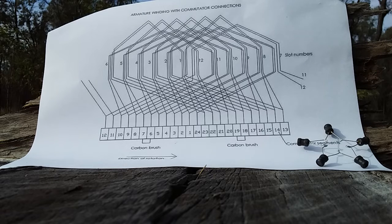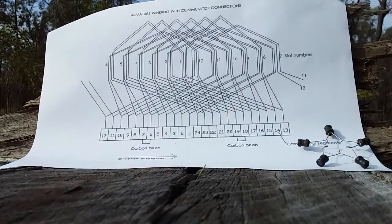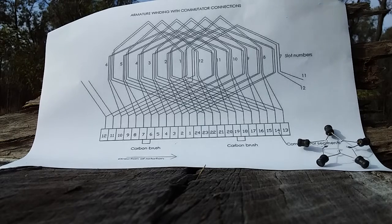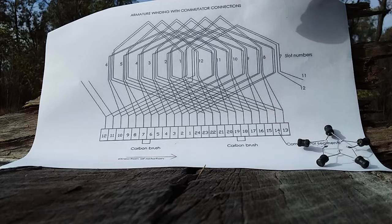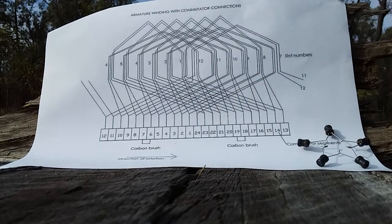As I stated in my last video, the rotor coils are joined in one big coil. You can see it there — you can see 11 and 12 come off, they go over here to 11 and 12. There is not a connection here that is individually terminated. It's one big coil, and every single segment has two coils going to it.